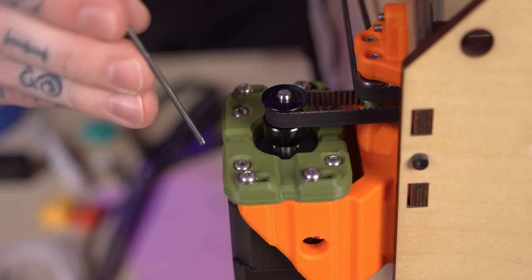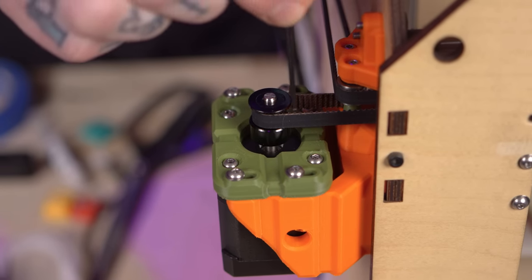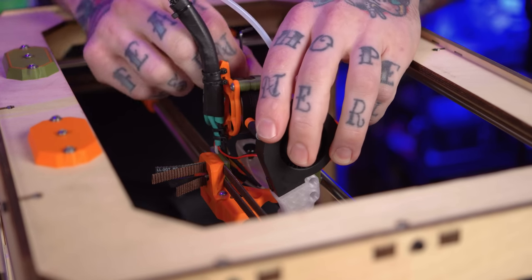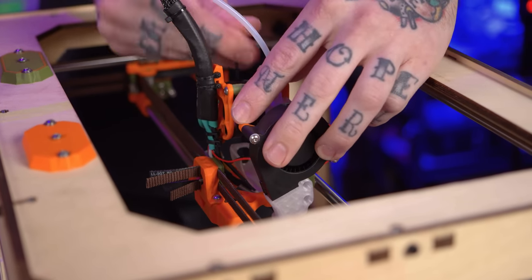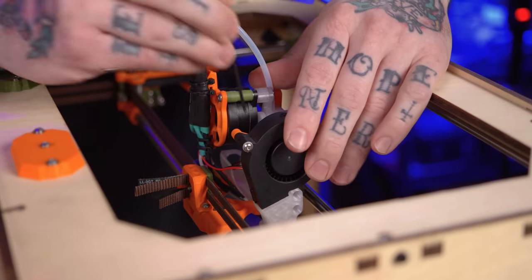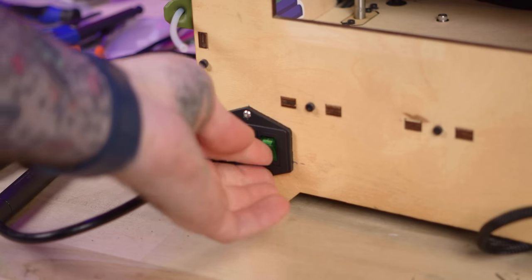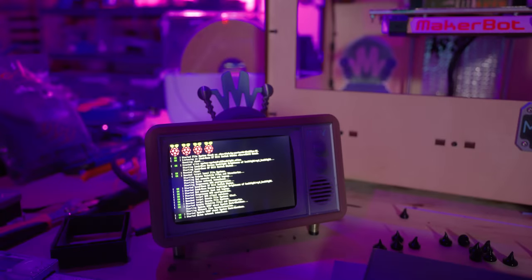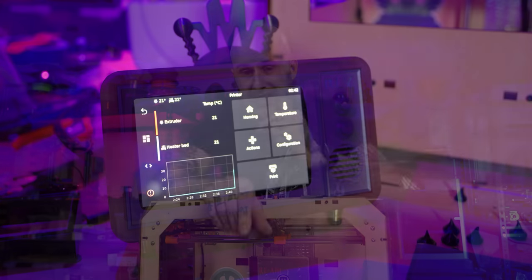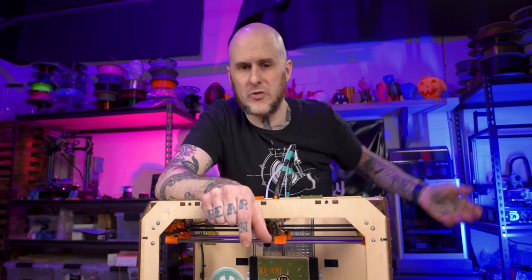I feel I have a little more slack than I care for, so I use needle-nose pliers holding the belts lightly, ever so lightly loosen the belt clamp, and then twist the pliers while holding the belts — it acts as a kind of pulley system to pull the teeth through their catches on the belt clamp and tighten the system a little more. I'm leaving a little extra length on the back of the belts to grab onto for further adjustments. I'll do a few prints, let the belts break in, and see where I'm at. I also have plenty of adjustment left on the motor mount plate tensioners. And then finally I can install the tool head onto the carriage — I am so very happy I designed this system to only need three bolts to remove the tool head and access those belts.